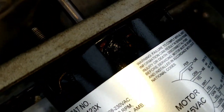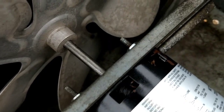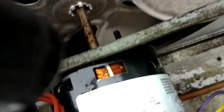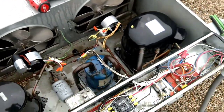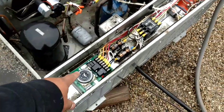I'm gonna put in that mechanical time clock. I don't like the way these motors have been exposed to water. Hopefully they don't burn up — oh man, look at that motor, it's probably toast. Let me see if I can take this off. That motor's probably toast; this one does not look bad. Yeah, that looks black all inside, so we might have to change that out as well. Let me disconnect that and ohm it out — that one too, just as a precaution. I'm definitely changing out this clock.